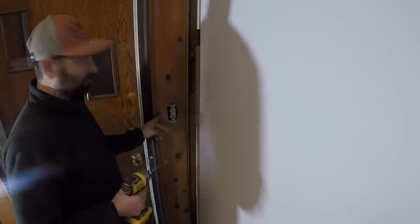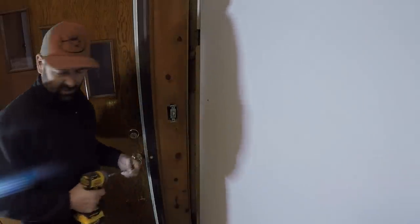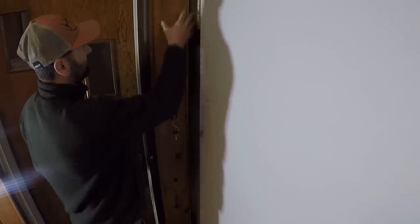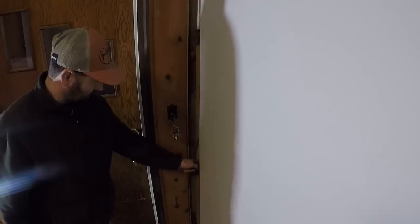I still need to keep the lights on in here. This is a three-way. I can see a three-wire up here going to these lights and it goes over to the door out that way. I'm just trying not to shock myself. You've got to pull this board off to get access to all those junction boxes that are in this wall. And I'm sure this outlet here is just pulling power off of that — it'll be real easy to get that out of there.